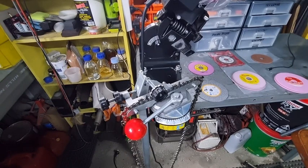I have seen severe cases where people are really heavy-handed with the wheel, and they can really damage the teeth because they turn it even hotter than blue. You really can damage the metal if you go to the extreme. But if you've got a slight little bit of blue, that's not going to be a major problem at all. Just avoid the excessive blueness and you'll have no problems at all.